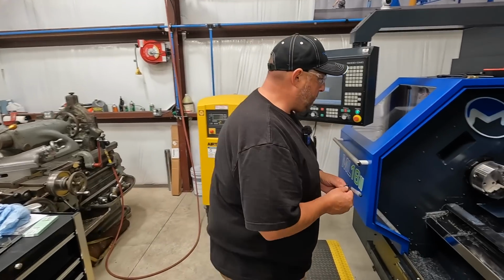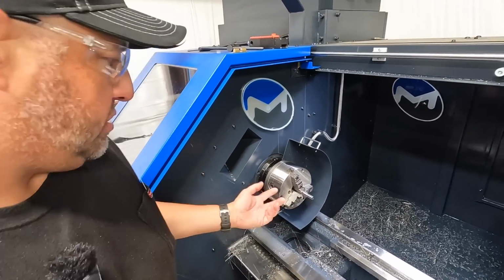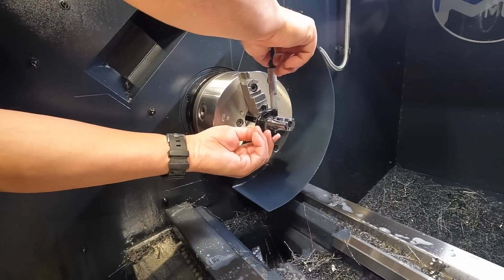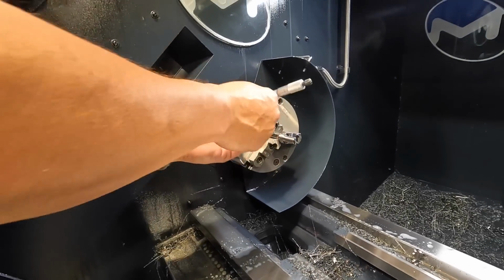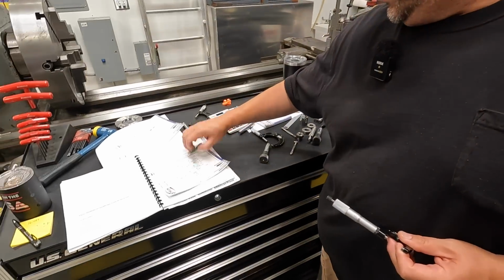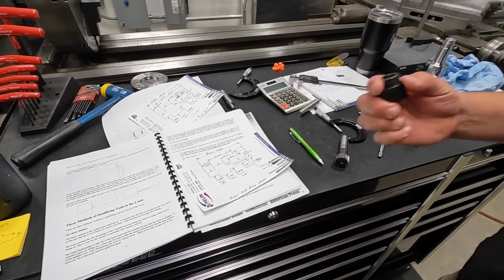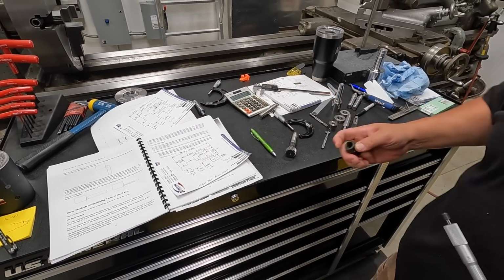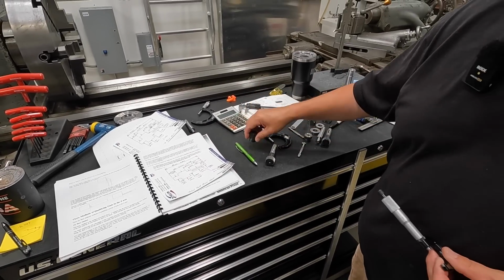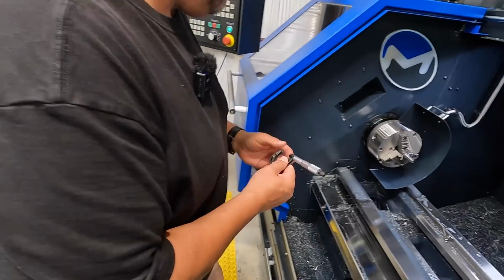We just finished op 2 here. This larger journal there, there's nothing that fits on it. I believe we got that one at 905 or 906. So we got it at 905 and a half. Yeah, we wrote down, this shows 23 millimeters. It's just to match this diameter of the gear right there. So that's not a critical one, but we want the journal that this gear is going to fit on to be pretty close. So we've got 591 written right there.